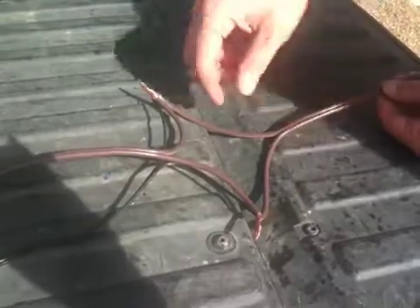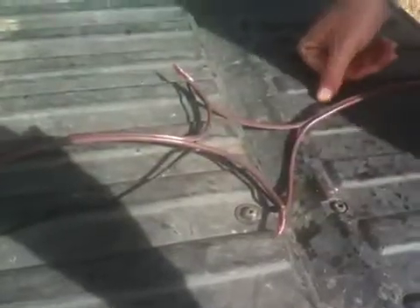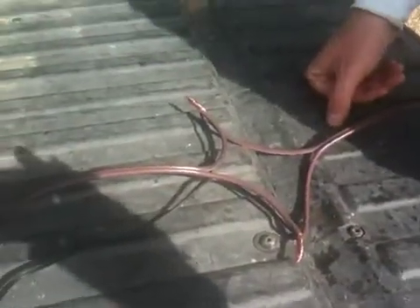So when we're all done it's going to look like this. If we had the fixture lead in — the fixture lead is representing this black wire — and then we have the low voltage wire coming in and the low voltage wire going out. Now we've got three wires on each one of the leads like so. That's how we make a connection using the Touchstone accent lighting system.